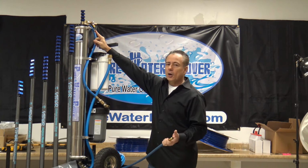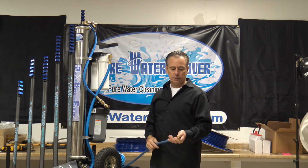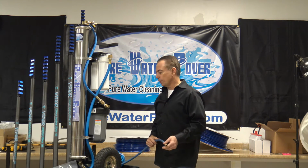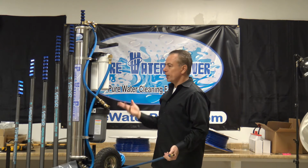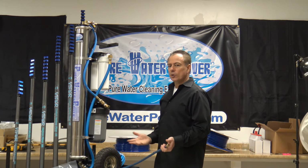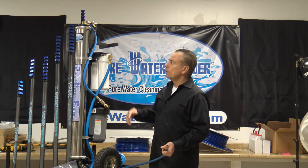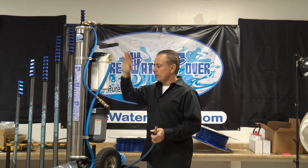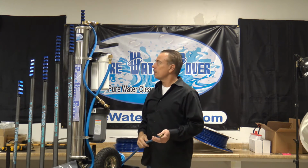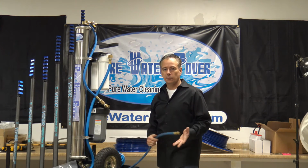So don't be alarmed, that's normal. And that's just the way these systems have to get rid of the high TDS water within them. So that's essentially how this will work. You run it, and then when you're done with the job, come back, leave the water on, go ahead and put this to flush mode for a minute or so, and that's going to flush that system, and then go ahead and put it back into normal, and then disconnect everything, and you're ready to go.